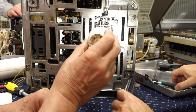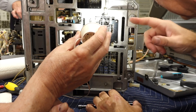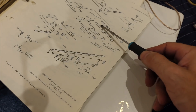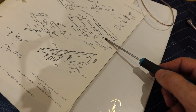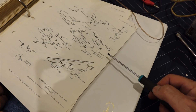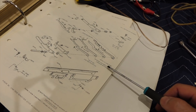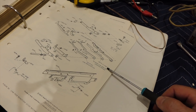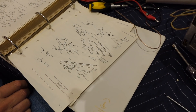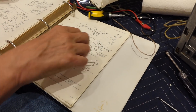If that doesn't work, then I'm sort of out of ideas, so we should look at what that lever is. We think the lever that we just figured was stuck is the line feed lever — I'm pretty sure it has the exact right shape. So that could explain why the line feed didn't work, but it still doesn't explain why we would decode a bell when stuck in the control mode. Is there something called a control lever? It's one of the selection levers — it's one of the bits.